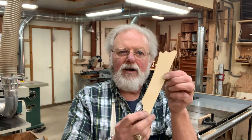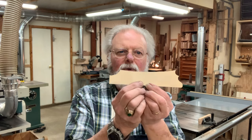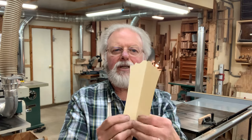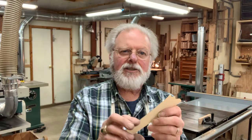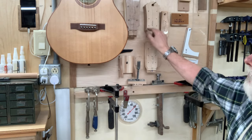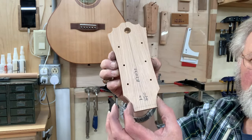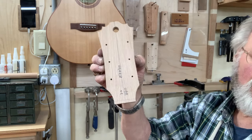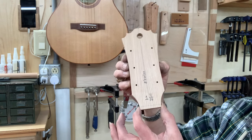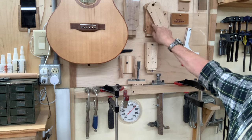A quick review, or a step back if you will. I design my headpiece using oak tag or heavy paper, and I do that with a symmetrical system starting with the center line, so that I can shape one half of it and the symmetry makes itself. When I'm all done with that, what I have is this wall full of headpiece templates. These are made so that one headpiece might be for a one and eleven-sixteenths nut width, another for one and three-quarter, or in my case one and seven-eighths inches wide. So I've got them for each neck width, but also for each instrument I build.